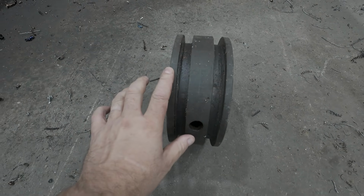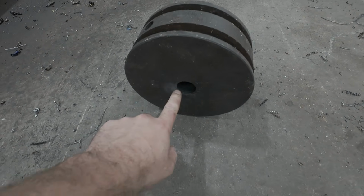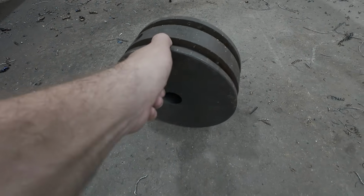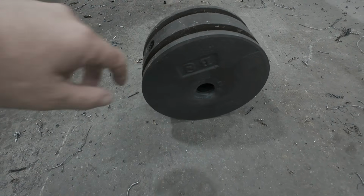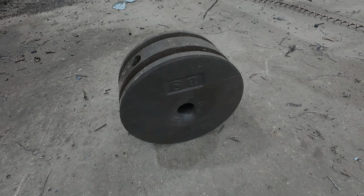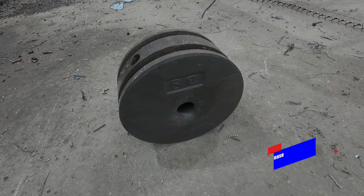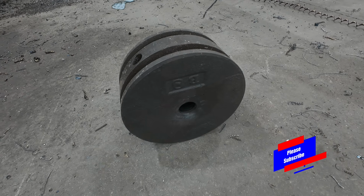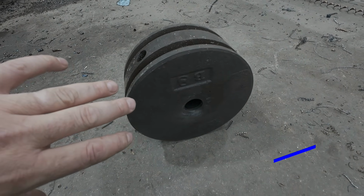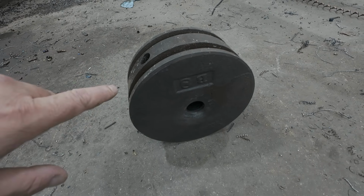So what we've got to do is make the body, make the ring grooves, bore it for a taper also, but I'm also going to dish the faces on both sides for a little bit more steam space. So we'll have a little bit more power. Essentially stroking it is kind of what we're doing, or some people would say like a hemispherical head, except it's the piston. So we're just creating more steam space for more expansive force for more power. So that's what we're doing with the aluminum piston. So let's get it up in the lathe and let's get started on the turning.